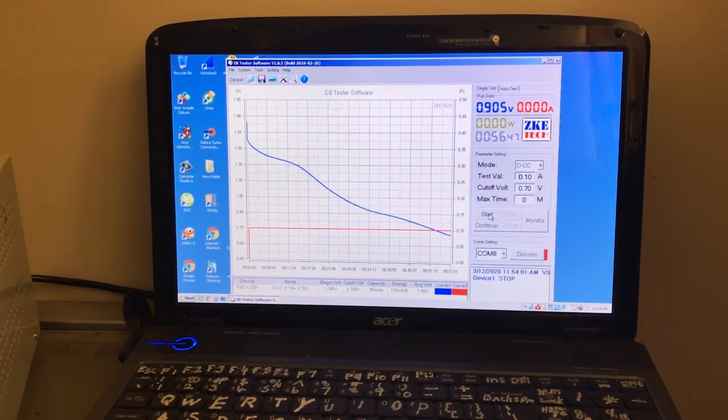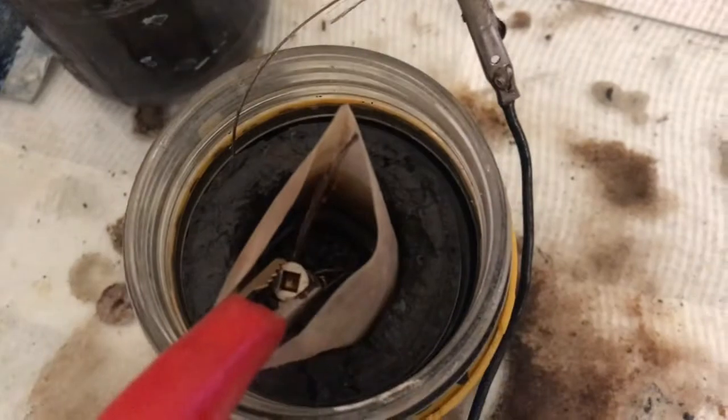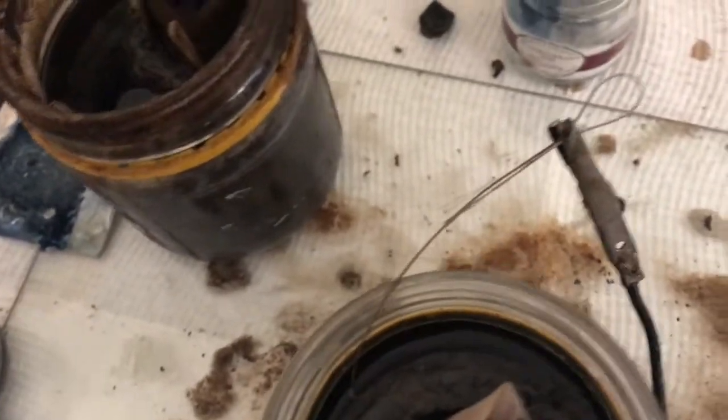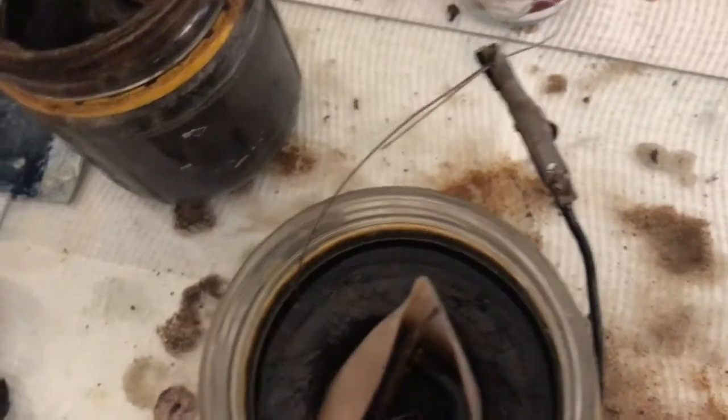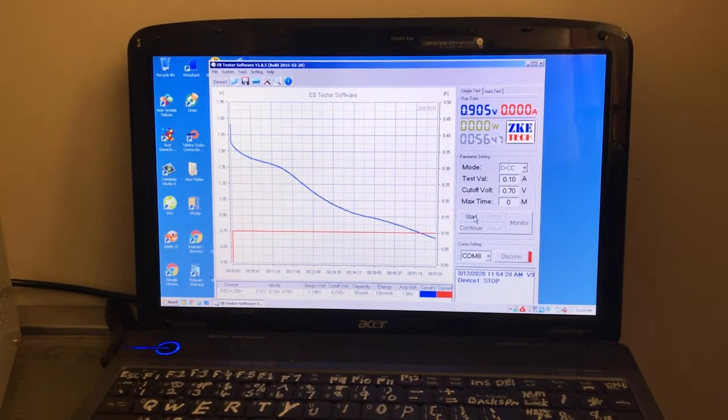Okay, somewhat down a bit. It's 102 milliwatt hours, but I have here 0.8 grams of zinc powder, so I might try to increase the zinc in the electrolyte by adding that powder down the sides there, and then it will just eventually dissolve and go into it. So I'll do that now, and that will be 3 grams of zinc oxide and 0.8 grams of the zinc powder for the next charge.